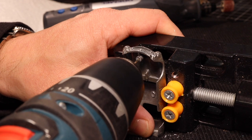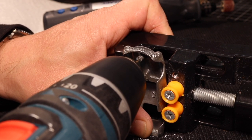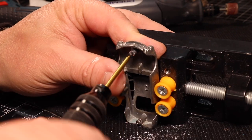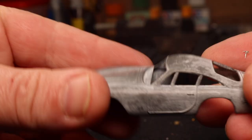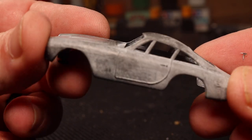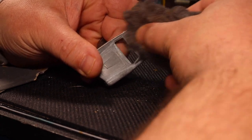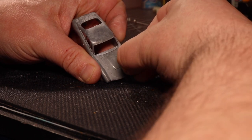I'm using the small bit that I started with at the beginning of the video to drill those holes a little bit deeper. Then I will use my 2-56 tap in order to tap the holes. Once I have that done, I'll install the screws. Although I didn't film it, I did end up electroplating this chassis — and this is the finish you get after electroplating. The casting was in rough shape, so this was the only way around it. Then I take an SOS pad and some sandpaper to get all of that residue from the electroplating off.